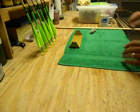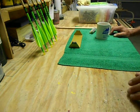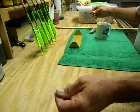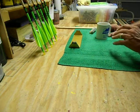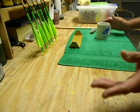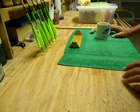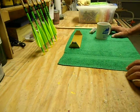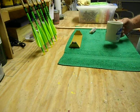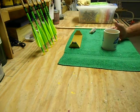I'll go through shafts generally three or four times to get them straight. Occasionally you'll get a shaft that wobbles — it's down on this end and up on this end — and you've got a shaft that's bending in two different spots. If you go through it, work one end at a time obviously, because you're working in two different directions. Those shafts are a little more difficult; it's caused by grain runout, sometimes twisting in the shaft. If you have problems with those kinds of shafts, I don't have any problem ditching them. Some of them go straight really quick; some of them are a royal pain.